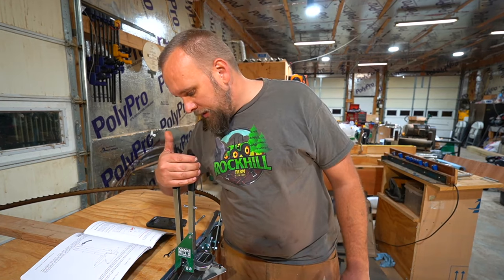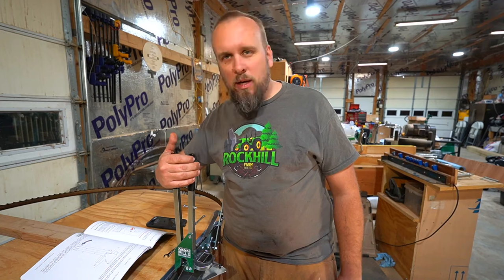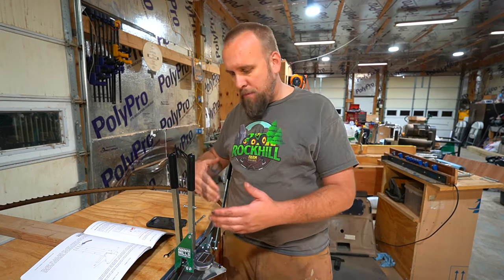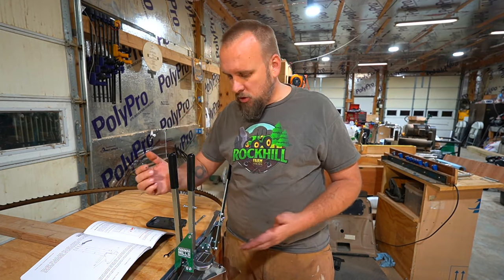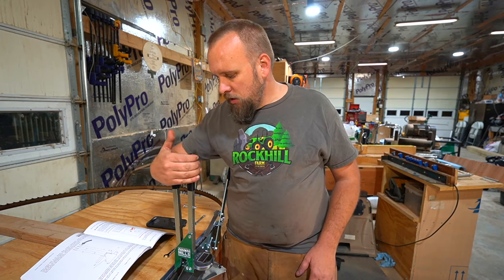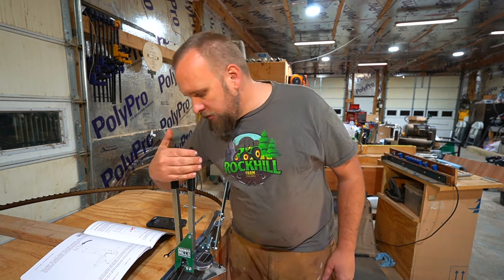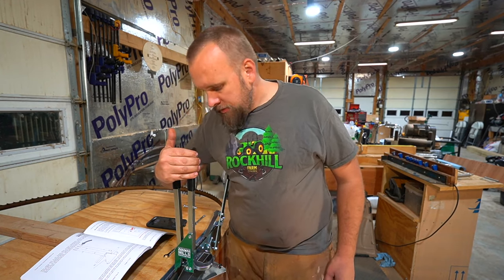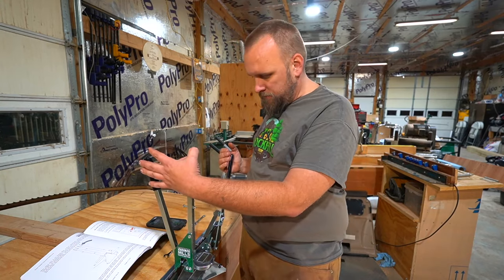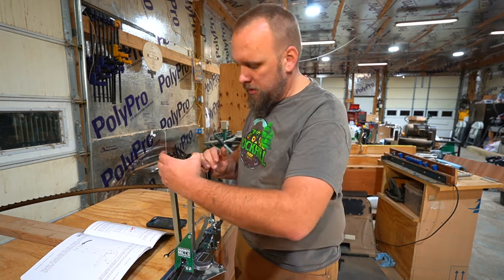Now instead of bending it, I can just push this in and get the reading. This one's currently at 0.38. So when the blade was new, it had a 0.55 offset. Currently it has a 0.38 offset, so it's been flattened some. So now I'm going to squeeze it all the way down to give it a new offset. Now it's 0.57. So now it's a matter of repetition. So I go one, two, three,